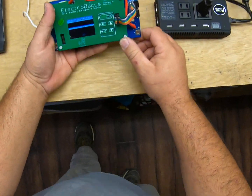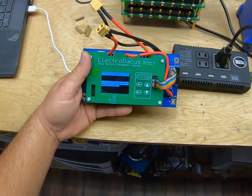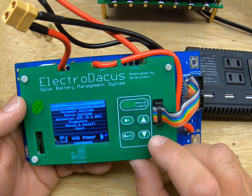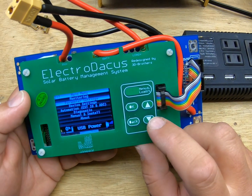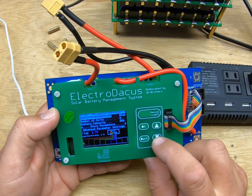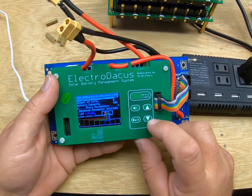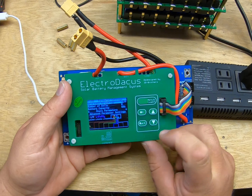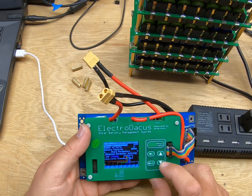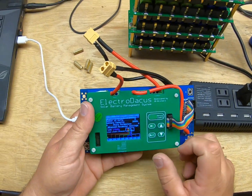This gives you a spot where you can read the display. We're waiting for it to boot up — bear with me just a second. Now in the main menu — I know it's hard to see on screen, I'll try to get a bit closer. We'll come down into parameter settings, click OK, and the first option is going to be cell type. Click OK there and the first option is for LiFePO4 batteries. I'm using lithium-ion so we go down one. Hit enter first, then go down.